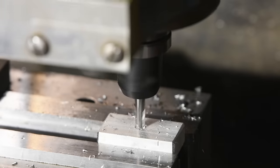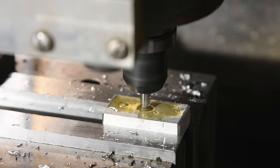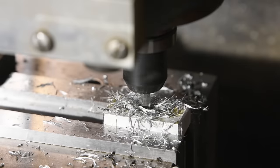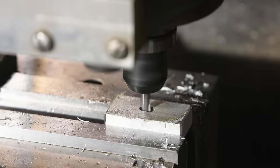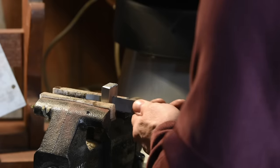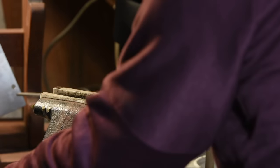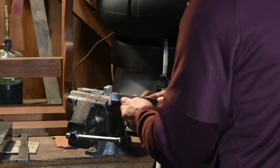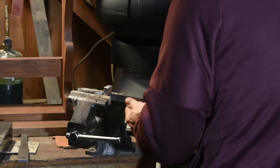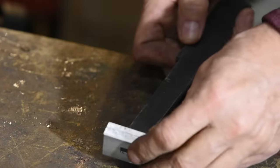Typically, hidden tang knives have some kind of metal guard. To save wear and tear on my fingers as well as to save time, I'm going to fabricate a dummy guard from aluminum, though more typically they're made from brass. You can also use Damascus steel, stainless, silver, wrought iron, whatever. I'm milling the slot, then cleaning up the shoulders with a file. Guards often come pre-made, but if you want to make one yourself and you don't have a mill, you can drill a series of holes and then file everything out — more time-consuming, but you get the same result. All the parts in this video are going to be made from cheap, soft materials, and I'm not going to properly finish anything — all we're trying to do is demonstrate the basic construction methods.